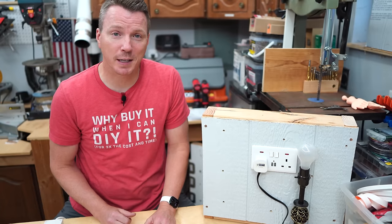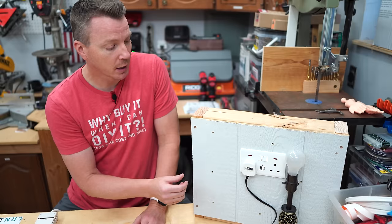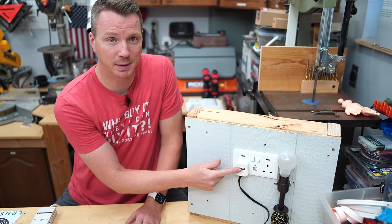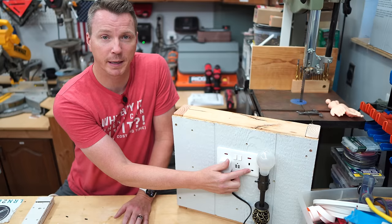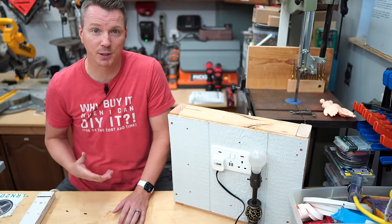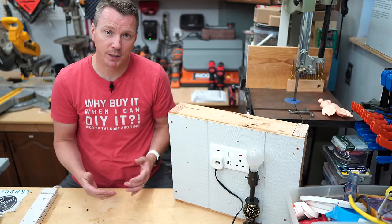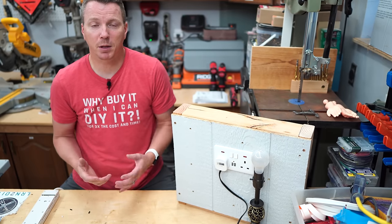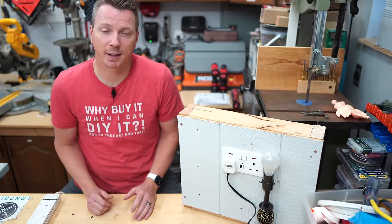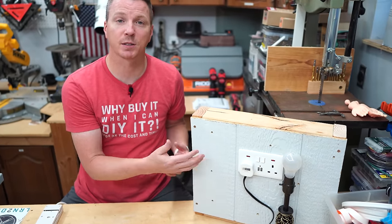Running on 230 volts has a lot of impact on how you can use the outlets and receptacles around your house. So for example, if you want to plug a lamp into this, no problem obviously, but you can even plug a much larger appliance over here. Let's say a washing machine, for example, something a little more power hungry. Space heaters have been a big issue for tripping circuit breakers here in the US. On 230 volt, they can handle that a lot better. You can even plug in things like a hairdryer and an iron at the same time in many cases, especially if the gauging of the wire in the walls is appropriate for that kind of use.